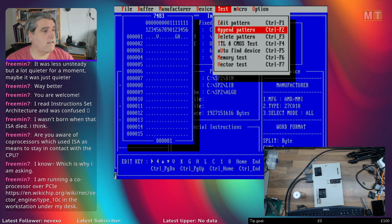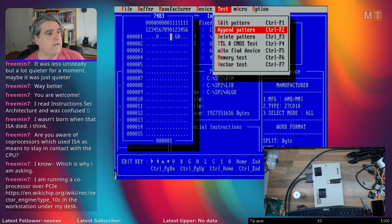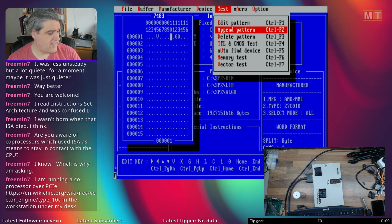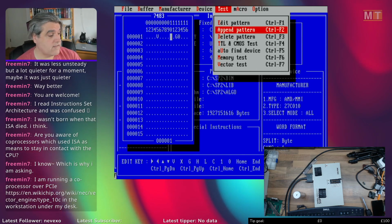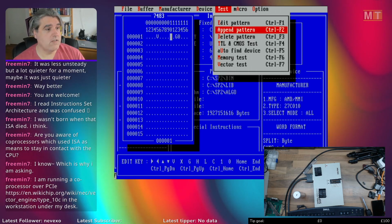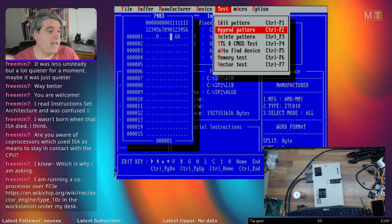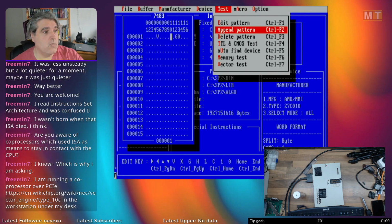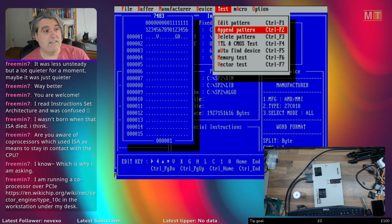And that's the vector engine. That'll be a vector code processor, which is more like a GPU for doing specific tasks. In the times of ISA, there was only really the processor and the coprocessor, which was the maths coprocessor. GPUs, there was no real concept of offloading work onto the GPU because it was in general a one direction connection. You'd push data out to the GPU and it would display it, or it would calculate it and display it. There wasn't really the backwards and forwards of information that you have now, because the ISA bus is, by today's standards, horrendously slow.